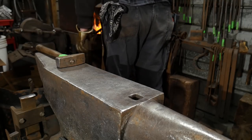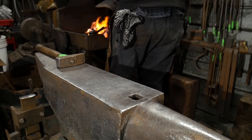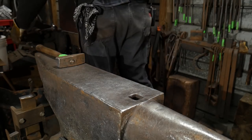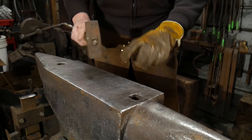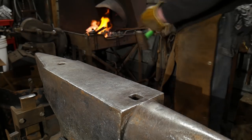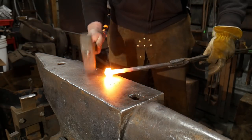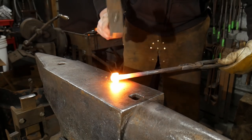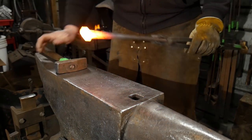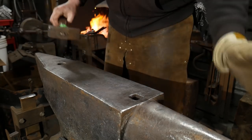This is getting really close to welding heat. I can't see either the end of the bar or the collar, so now we're going to weld this up. We're going to go with some light quick blows and just keep rolling it, keep rotating it as we go. Pick it straight up out of the fire. We're going to work that scarf together and straighten this up a bit. That's basically welded, but we're going to put it back in the fire, bring it back up to a nice welding heat, and go at it again.